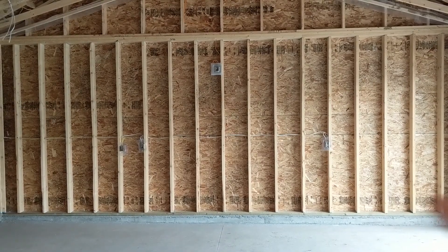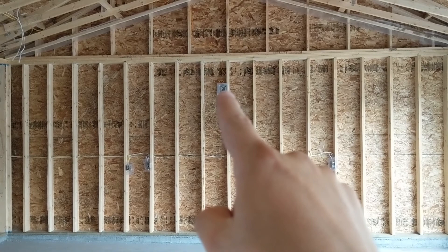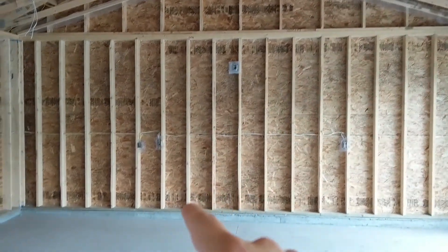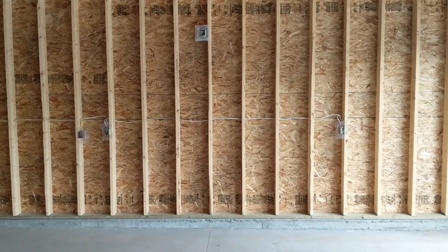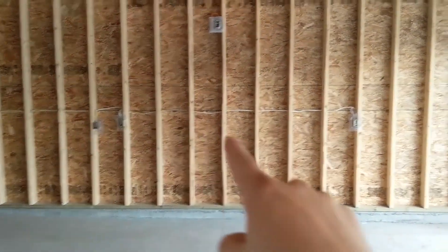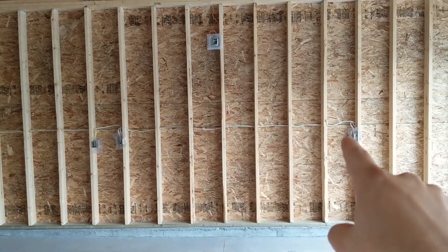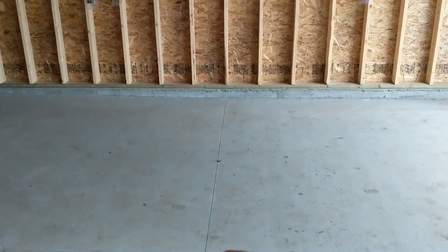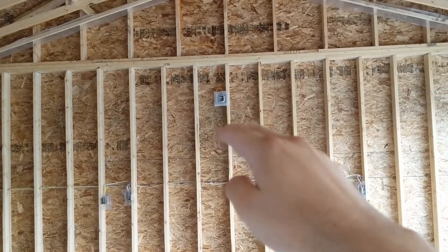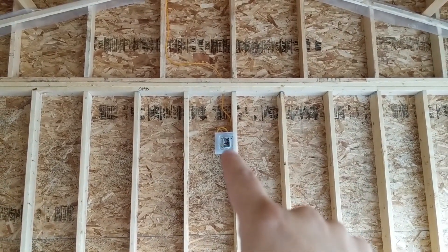With all that in mind, how about the north wall? This is the only one I actually had a pretty good idea of what I wanted and needed. It's pretty simple — I need a 30 amp plug, which is what this is, to operate the hydraulic lift, and I wanted two lights on the actual side of the wall. There's another guy in the neighborhood who's already done something like this, and he said the very first thing he did when he built his lift space was add lights lower down, because as soon as the car goes up, you've lost all of your light. So I went ahead and got two extra sockets put in, and we can run some nice long strip lighting down at around the two or three foot level. These two lower lights will be run off of their own switch right here.